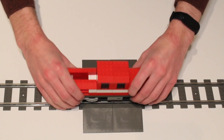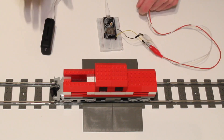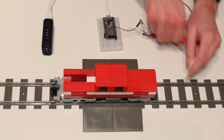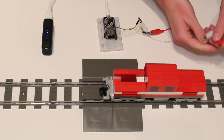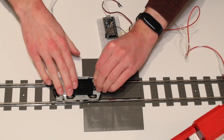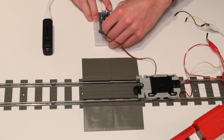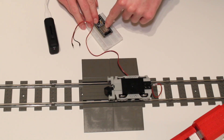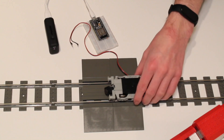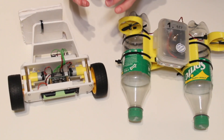Let's start with making this train move. Luckily these old Lego trains use a very simple method of propulsion: a DC motor. What I've got here is a simple power supply — I'm just using the microcontroller to split the power. So this is five volts going straight to these two clamps, and if you connect them to the old rails the motor moves and the train moves with it. What's nice about these Lego motors is that they also offer a little port where you can connect the Lego cable to extract power. But of course I don't want to do that by hand the whole time — what do I have a microcontroller for? However, the microcontroller is very smart but also very weak and wouldn't stand a chance against the power electronics of these motors. This is why we need a motor driver in between the control electronics and the power electronics.